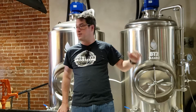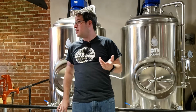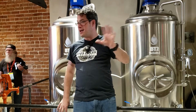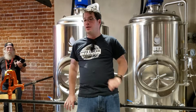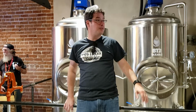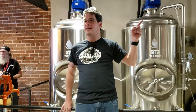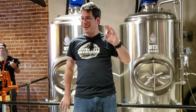We basically designed it specifically to be able to work with corn because when making chicha, traditionally you boil with the grain still in there. I tried it both doing that and the Western European style of mash separate from boil. Flavors come through much more strongly when you boil with the grains, so we built a system that allows us to do that. The theory on it is you mash for 90 minutes, turn up the heat, start the boil. The practice is much, much more complicated, and we are now on 9 times that I've tried to destroy that piece of equipment. So 9 and counting.